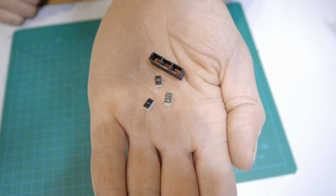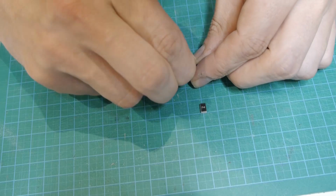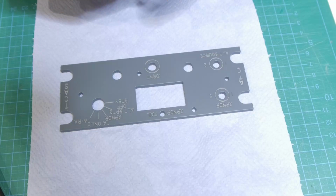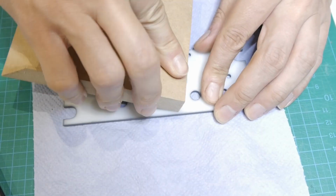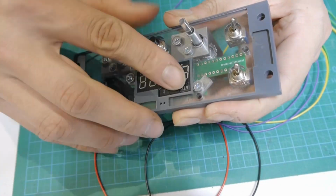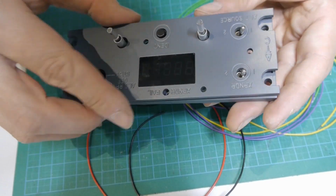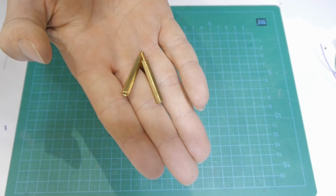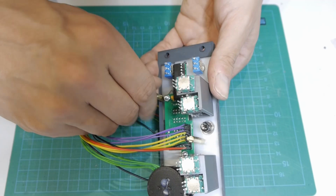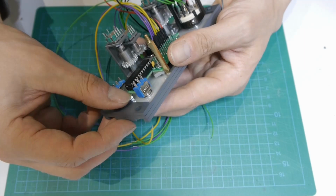To prevent the LEDs from spreading their light, every sign sits in its own light box. Because there are so many components behind this panel, I used 30mm hex standoffs this time to bring a little bit more room between the backlighting plate and the panel.